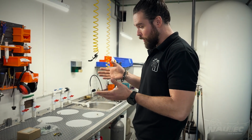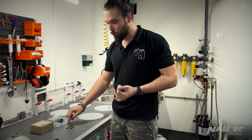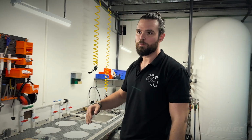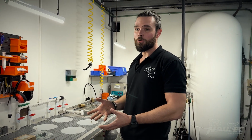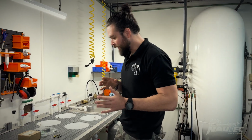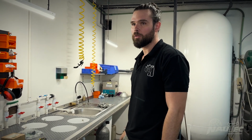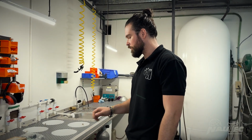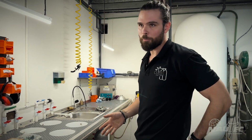And also NAUTEC seems to have solved that problem. So they solved two of my biggest problems. A very weak spindle, but also they put PEEK as a sealing material for lower pressures, and for high pressure they use a very special plastic that doesn't seem to have any memory. You can put a lot of force, you release, and there is no wear. That, working together with the strength of the design, you probably have 2,000 cycles in the valve without having to replace the internals. So I think that is a very clear advantage to the design and to the brand, because it directly affects your pocket.